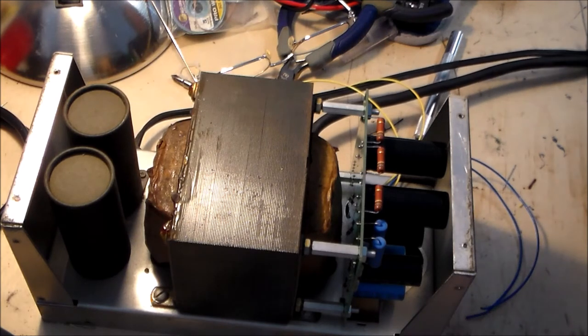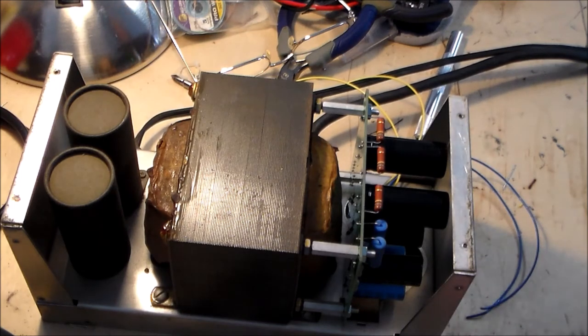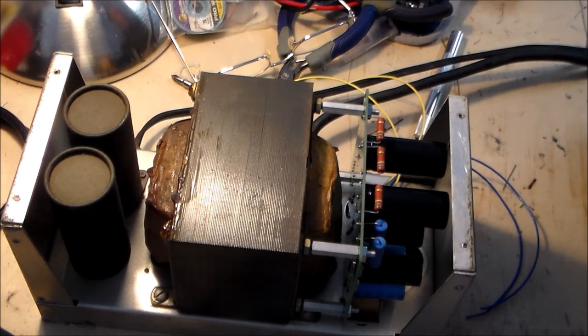Now, route the four wires, two blue and two yellow, through one of the old capacitor holes before mounting the extra terminal strip. In the next step, you may want to cut off or bend over the ground lug so you don't solder wires to this lug. Mount the extra terminal strip provided in the kit to one of the old capacitor holes using one of the old capacitor mounting screws. Mount this terminal strip to the mounting hole in the bottom most center capacitor.